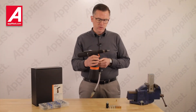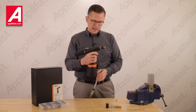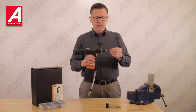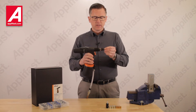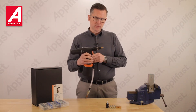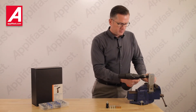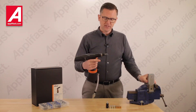I've set the tool up for quarter inch — we're going to demonstrate a quarter-inch fastener here. I'll turn the tool on. To install the fastener, I just press it against the mandrel of the tool to activate the tool clockwise, and the fastener goes onto the front of the tool and the tool stops rotating. I take my tool to the workpiece, pull the trigger, and when I'm ready I release the trigger and the tool backs out of the installed fastener.